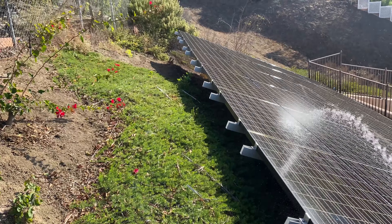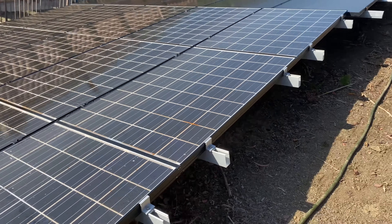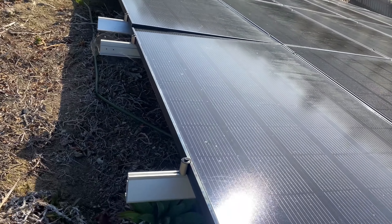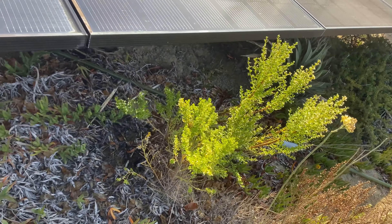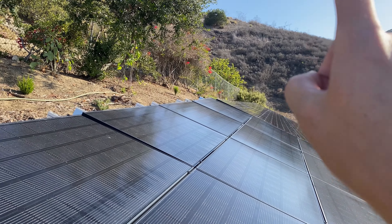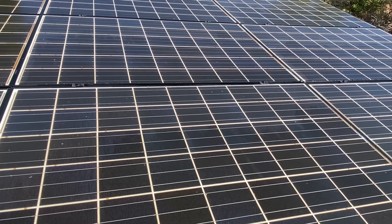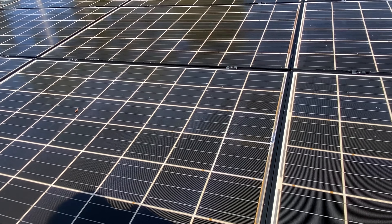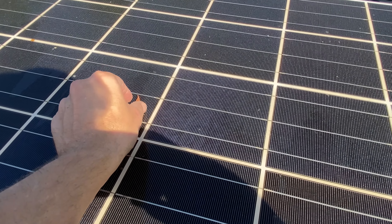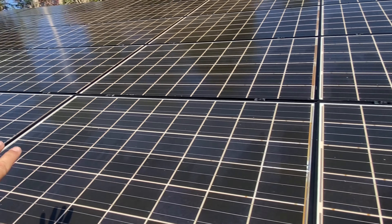You can see I've been out here for less than 15 minutes and these guys are shiny and clean — they've already dried over there. Another thing I'll do whenever I'm up here cleaning, maybe once every three to six months, is make sure there are no weeds popping up and nothing was left on the solar panels. Even some little piece of debris is bad for the string inverter panels, because it could significantly reduce that panel and the whole row it's on.